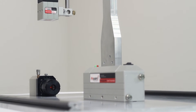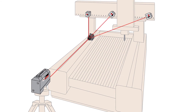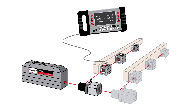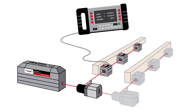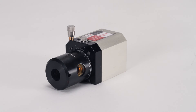This feature is very useful for precisely checking the squareness of gantry systems, press platens, parallel plates, and similar assemblies. The 90 line can also be placed in multiple positions to define precisely parallel laser reference lines, which is useful for checking the parallelism of rolls, rails and guides, press bases, and multiple sub-assemblies.